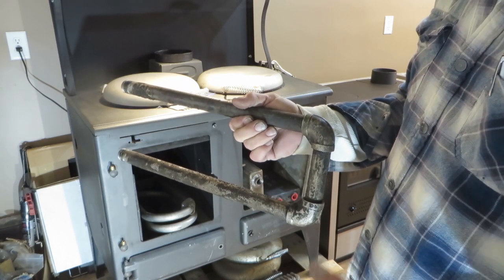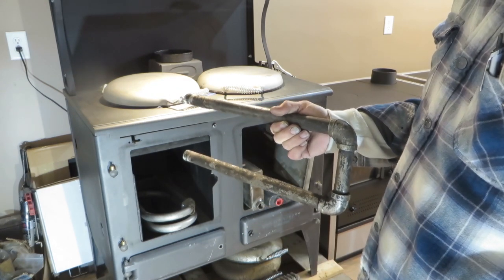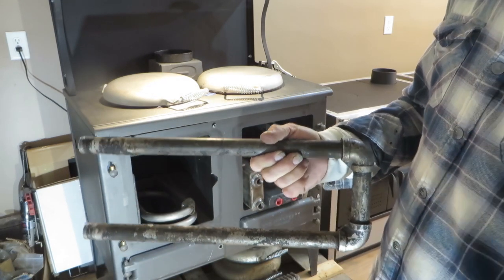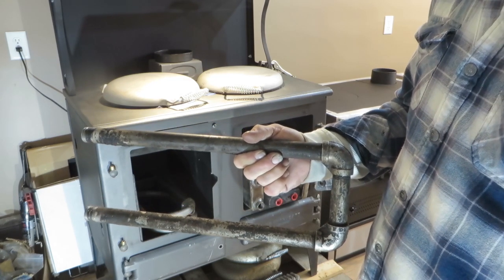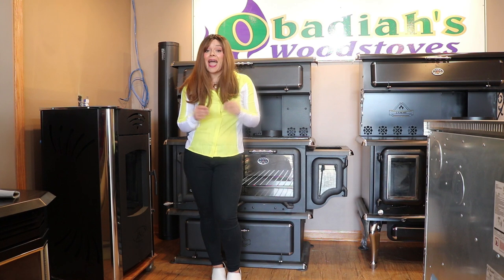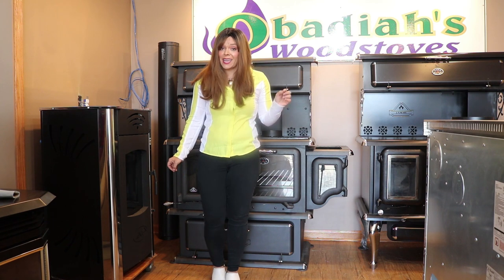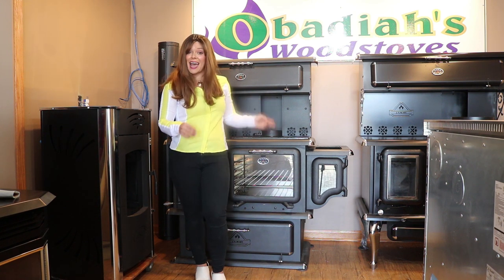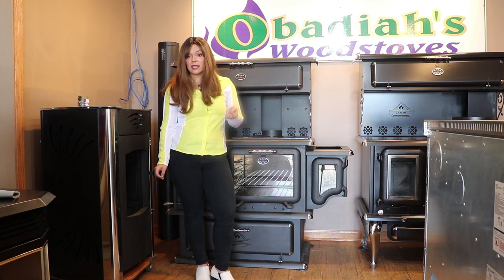Infrared rays - that's the heat that you feel that this absorbs. A coil of this would be enough hot water for generally two people in a domestic water situation. With domestic hot water systems, they do need to have water in them at all times. Once you install that water jacket into that stove, it needs to be hooked up and plumbed into water. If you fire your stove and it's not connected or plumbed into water, you will over-fire and warp out that water jacket. So definitely keep that in mind.